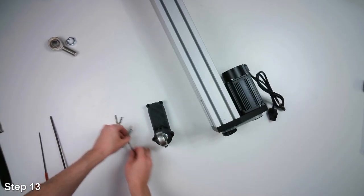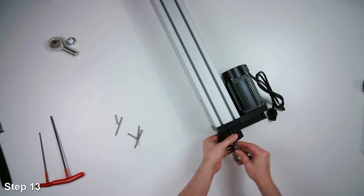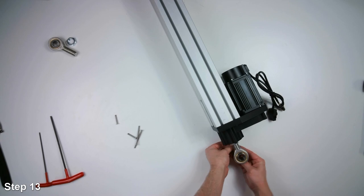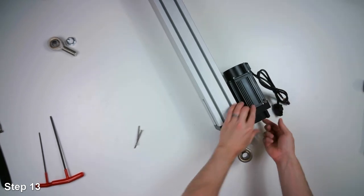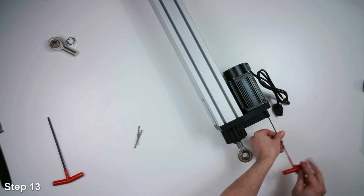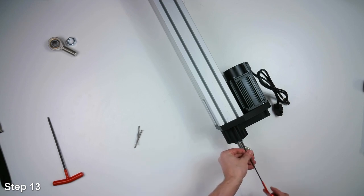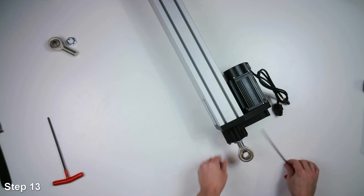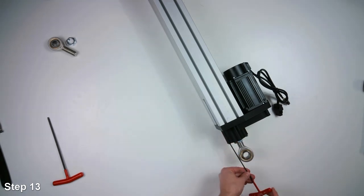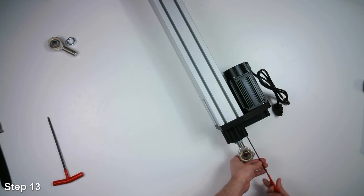We'll take these flathead screws and attach the bracket. Again, I'll partially tighten all the screws and then go around and do a full tighten to make sure all the holes are lined up. I don't want to get, you know, 5 out of the 6 screws in and tightened and then not be able to put in the last screw. So not doing a final tighten kind of helps them all get aligned. And then you can do your final tighten.